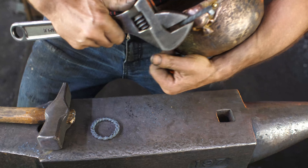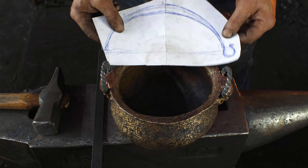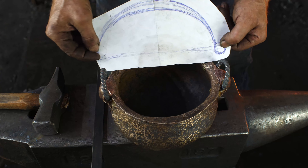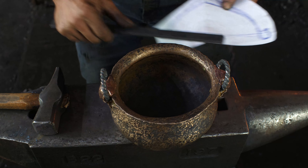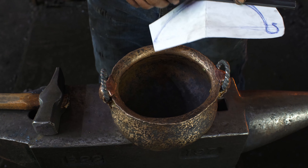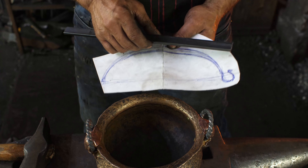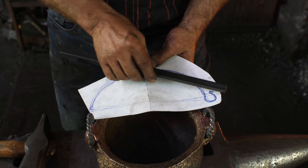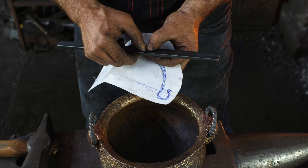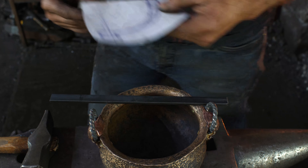It's now handle time. I've just come up with a little sketch here — that's half of it, just shows how it goes across. I wanted something fairly low because in my fireplace I don't have that much space, so I'm trying to do a low handle. I'm going to use this three-quarter by three-eighths flat bar and do a twist in the center, which will give it some visual interest and also be a little less hot to hold on to, then tapering out to something a little bit elegant. I've got more than enough material here — I'll do a center punch mark and start drawing out to see how much material I actually need.